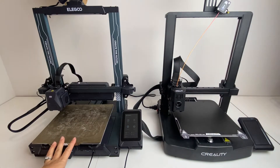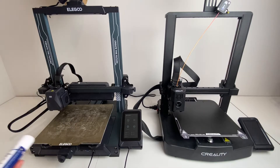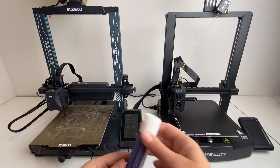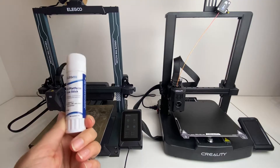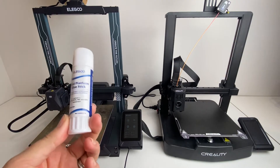This actually works great. Every few prints I put the glue stick down and I honestly don't have any issues with adhesion. Even though someone commented that my print bed needs cleaning, I actually haven't been having any issues with printing with a print bed this dirty, because the dirt and debris is really just the residue from this glue stick, which helps with adhesion. So it doesn't look the prettiest, but it's actually pretty functional.